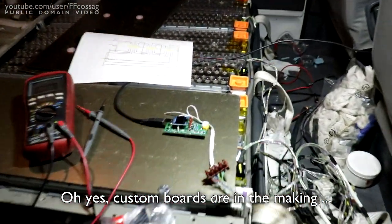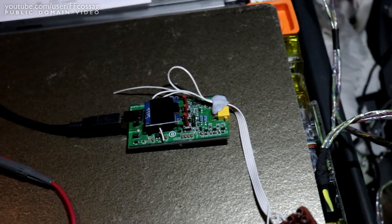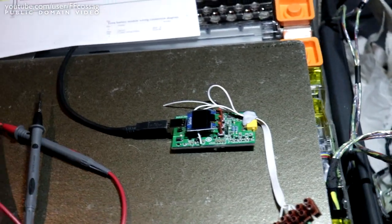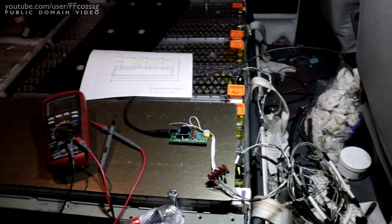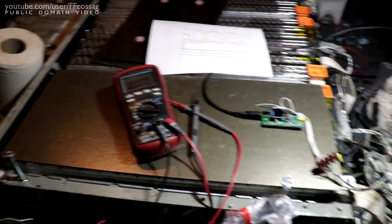Thankfully, this hardware has a high current output, so I'm hoping we can reuse it as a sort of dodgy relay driver. Then I'll have a relay do the contactors, and if it notices something goes wrong, it'll at least turn the contactors off. Super unsafe, not safe for production, etc., but it's going to let me play around a bit and actually charge the car.